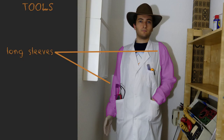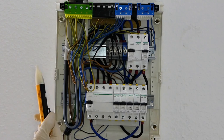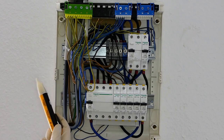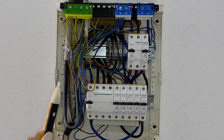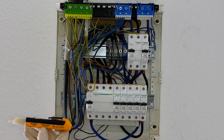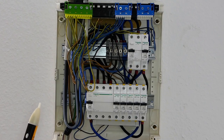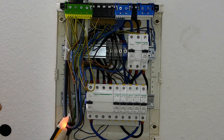I'm also using some tools. This non-contact voltage detector — as the name says, it detects voltages without touching any metal piece. You see here there are no metal parts, it's just plastic. This only works on AC and for this one it's from 90 to 1000 volt AC. If I go near any cable which has 90 to 1000 volt AC, you will see the light and then you will hear it also beeping.